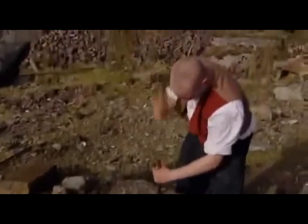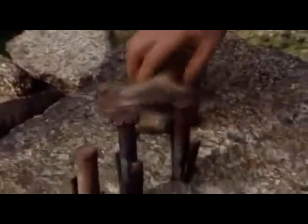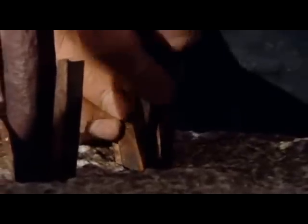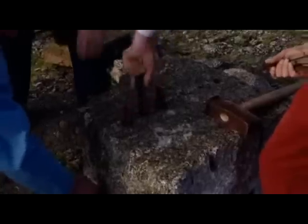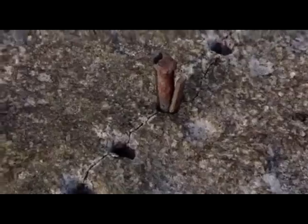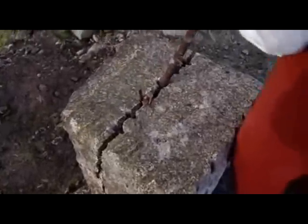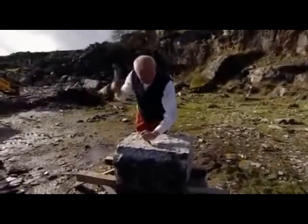Now the stone can be split. That's what they call the plug — plug and feathers. As you drive those in, it'll split the stone out; you just keep hitting them one after the other. This is the most critical part of the whole procedure. A clean break is essential, but they've got one chance to get it right. That's excellent — the split is clean. With the granite block cut to size, they can hollow it out to make the trough, a job that will take days.